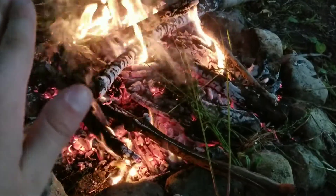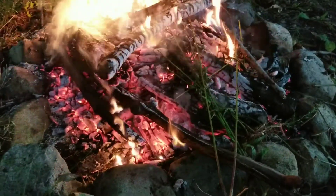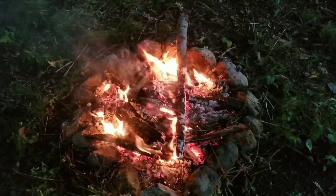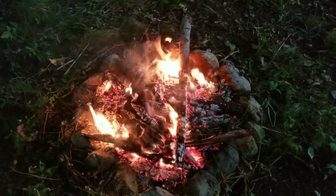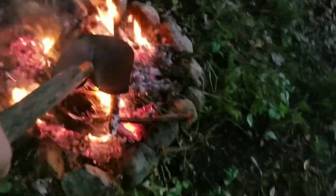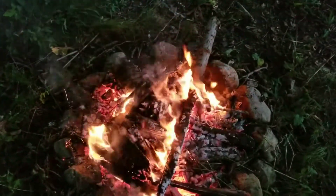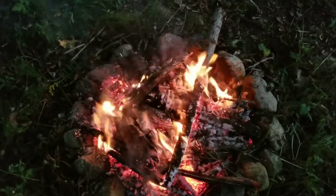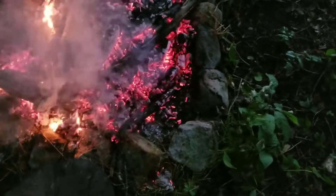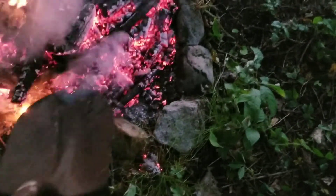This fire is still hot, and if I were to add more wood it's still plenty hot enough to turn wood into charcoal, but the coals that form don't have enough oxygen to burn themselves. Once the fire gets to this point there's going to be a lot of smoke coming off of it, which is good — it shows that the combustion is incomplete and inefficient. Bad news: don't stand in it and be careful, because there can be a lot of carbon monoxide in that smoke due to the inefficient combustion. Fires will arise but they'll typically tend to put themselves out; if they start growing instead of sputtering out, just bury them or hit them with the shovel.